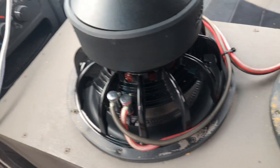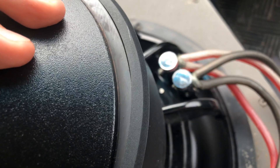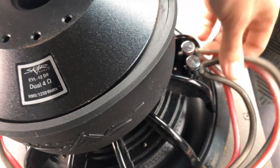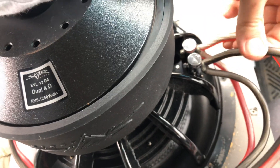To make this four-ohm subwoofer a two-ohm subwoofer, I run a jumper from one side to the other. This side has one set that just goes over to the other side, and then from either side I have another set going to the amp.